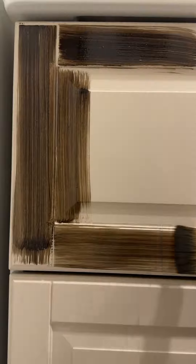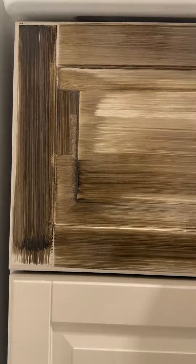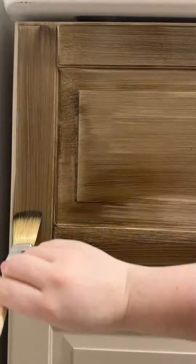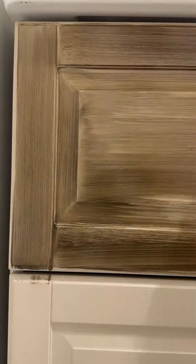This phase has a ton of wiping off to achieve the faux wood look, and I had a second chip brush on hand that I used to wipe off the excess until I was satisfied with it. Stain and Finishing Oil is an oil — the open time is hours long, and unlike paint, you can apply more and the oil will blend into itself seamlessly.